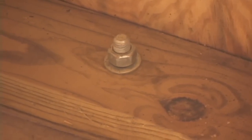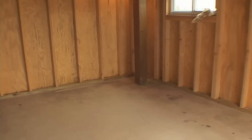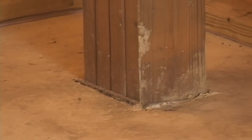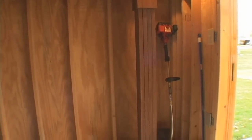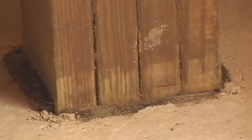I used pressure treated lumber for the bottom of the wall and a sheet of foam underneath to prevent moisture from wicking into the boards. The deck posts and beam are large, screwed and glued planks, and yes, they were very heavy to install. You can see here where I marked the amount the concrete heaved that first winter.